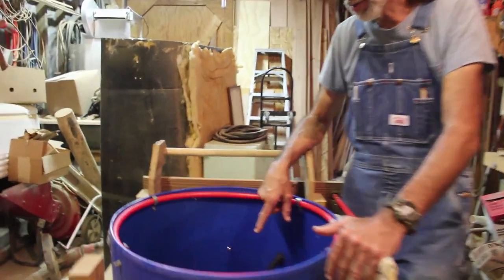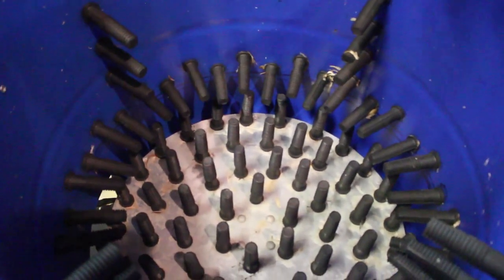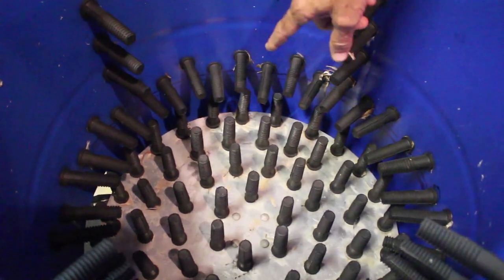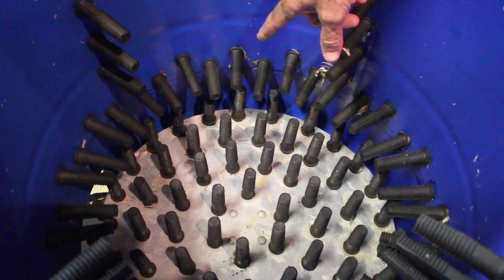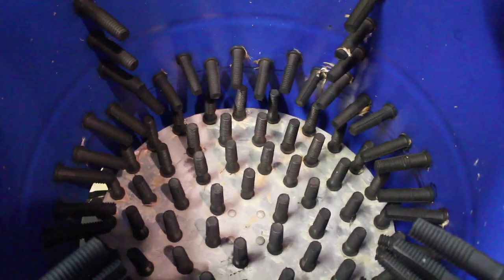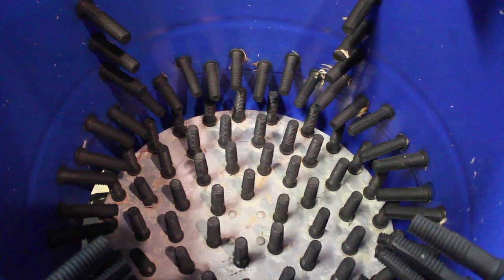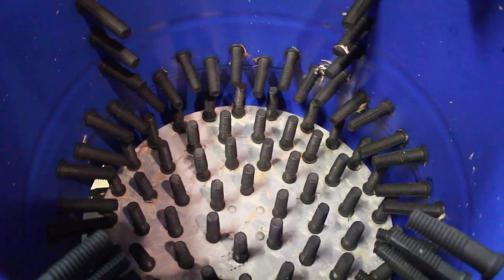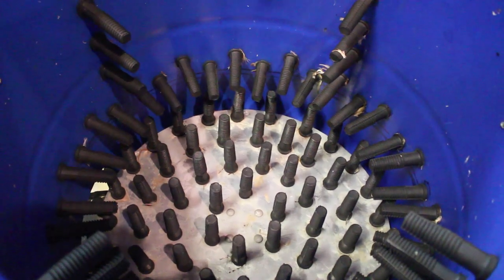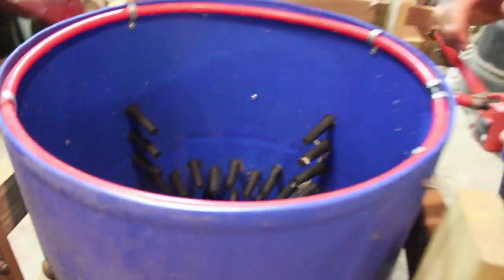There are about 150 of them inside this one that I built. It took me probably over a week just to put them in there because they're that hard to put in. In the bottom of this I custom built a steel plate — you can actually order this plate from Whiz-Bang, but I was trying to save money. I went to a steel fabrication place, bought a piece of metal, came home, cut it myself, and drilled all the holes myself using the circumference measurements Whiz-Bang gives you. Installing the fingers in that steel plate was probably the hardest thing of the whole deal.